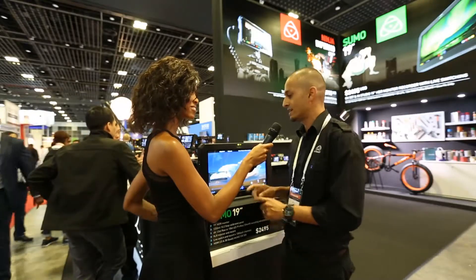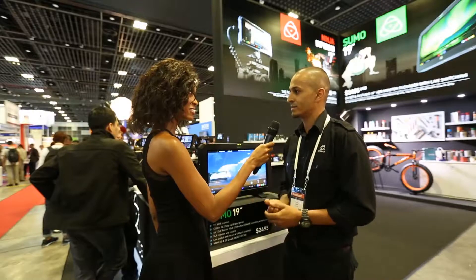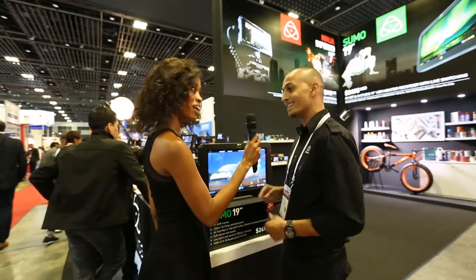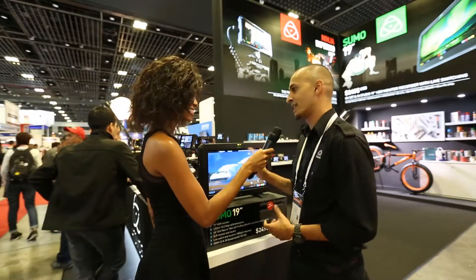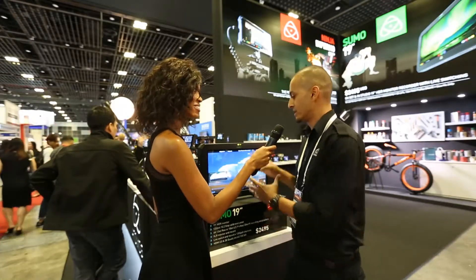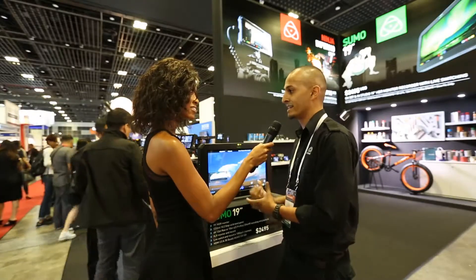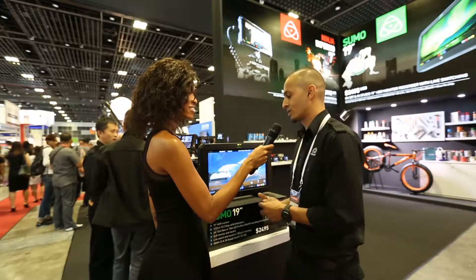We're taking four streams of HD, we can multi-view and we're also adding a switching capability. You're going to be able to switch live — and it's touchscreen. So you'll be able to touch the channel you want to cue and then record. That will be quite a non-destructive way of doing it because we're doing ISO streams and we'll accommodate that with an EDL or XML file. This makes your switching quite non-destructive.